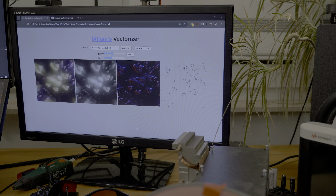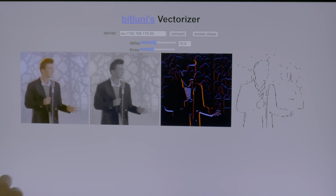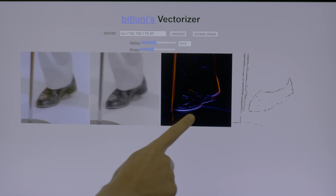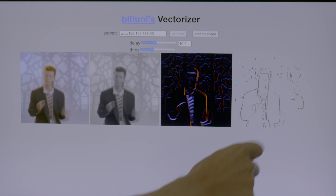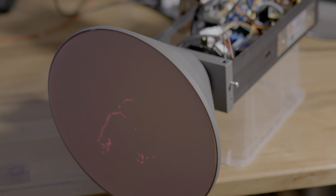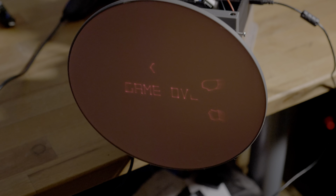But I wanted to revive the idea of sharing a screen to the device, just like on the mechanical TV already. I just needed to take the image, perform a Sobel filter to expose the edges, and convert those from pixel magnitudes to actual vector lines. Since it's transferring the vectors over WebSockets and Wi-Fi there is a delay, but I love it already. Although it's not as stylish as the mini TV, the function-driven design made it also look unique.